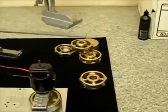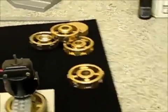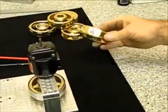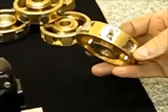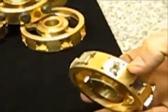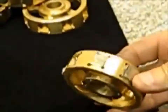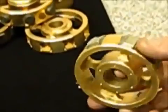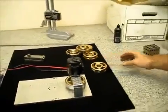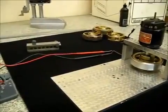Now I'm going to show you some of the wheels that failed with the magnetic arrangement. It took a lot of research to get the right arrangement, and when we did get the right arrangement, some of them exploded — came apart at high revs. This is one that came apart; it could have been very dangerous. So be careful if you're trying to duplicate this. We actually encapsulated the magnets, as you can see, with a band to stop them from flying out.